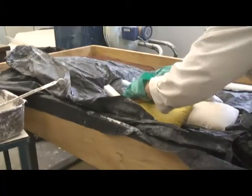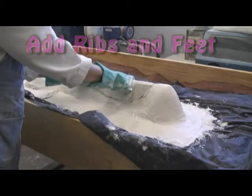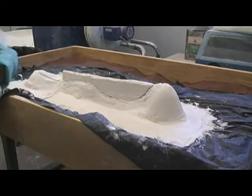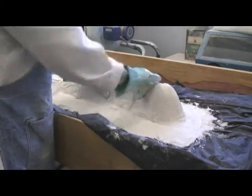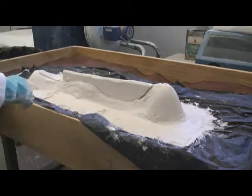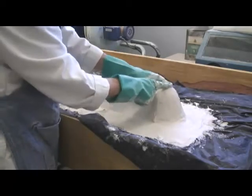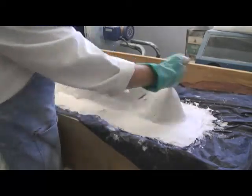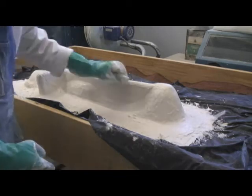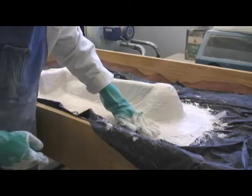When the plastic is removed, the plaster has a good rough surface for the second layer to adhere to. Do the second layer within about an hour so the first layer doesn't dry out. Wet the first layer with a water spray bottle. Cover the entire area of the jacket with a layer of plaster and fiberglass for a good bond, then add the ribs and feet made out of polyethylene foam. Put several layers of fiberglass on the feet and along the edge of the rib for strength. Remember, the strength is not in the polyethylene foam — it is in the number of layers of plaster and fiberglass used. The foam is only a spacer.